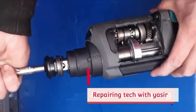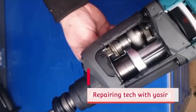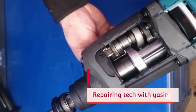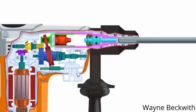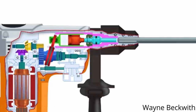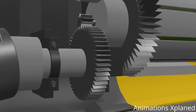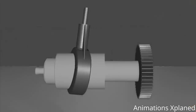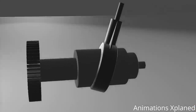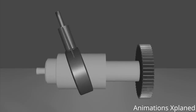On an SDS drill, switching between modes goes from standard drill mode to drill-and-hammer mode. This uses an asymmetric wobble cam — or usually a yoke freely moving on a center-pinned axis — to perform its own version of compressing air against an opposing piston that hits a rod or directly onto the bit. This is also similar to how reciprocating saws work: a fixed slotted cam causes that back-and-forth movement. But on a recip saw, if you accidentally impact something on the tip of the blade, all that force is transferred directly into the tool and at you, because of that fixed pin and cam. No air cushion piston here, but it works best for that back-and-forth sawing motion versus sudden impact blows.